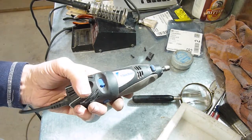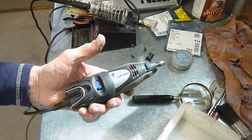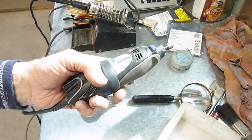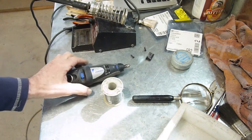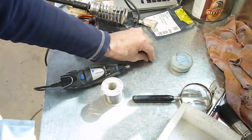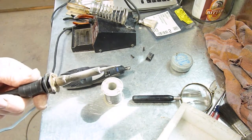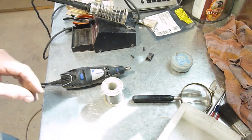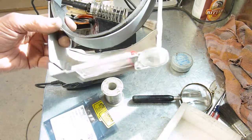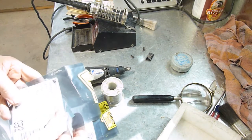Well, it's working but it's a failure — you can turn it off, but you've got one speed, that's it. There's probably something else wrong inside. But at least I have some Dremel left. The triac was very difficult to get in — this iron is not fine enough for the work, and that's the finest tip I've got. That was a problem; it was very fine to work with. And I did have one of the pads lift off, so I had to put a jumper in. All in all, not the greatest.